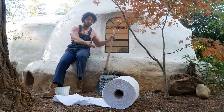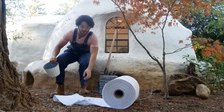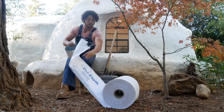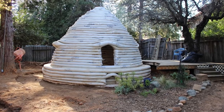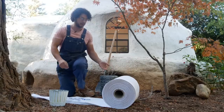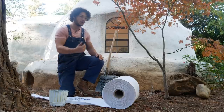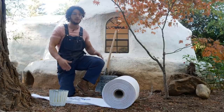On the south side of the dome, this is basically what you need to build one of these — and it doesn't look like much but this is actually what it takes. We're just talking a shovel, barbed wire, and a coffee can for filling these bags. We're building the structure in layers, and in between the layers we've got barbed wire — you cut it to the length you need, lay it down, keep stacking. It's really simple, honestly.